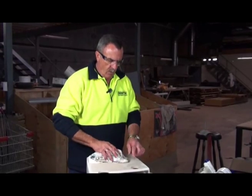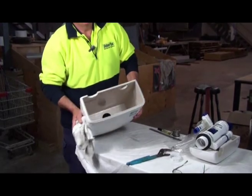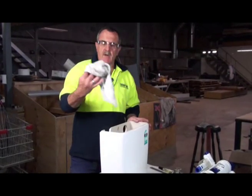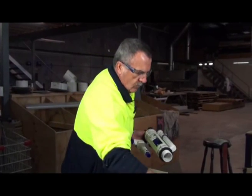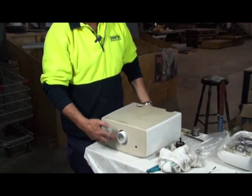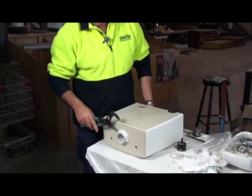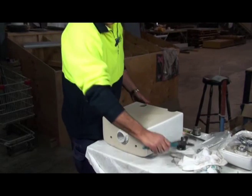After you've finished drilling your hole, just make sure you wipe off all the excess — not only on the outside but on the inside, because it could get in the way of flushing. If there are any big chips in there, just wipe it out with a rag. Once you've drilled, don't forget you've got to put your working mechanism back inside. Just reverse the steps you did to take it out — poke it through the bottom, spin the base nut back on. Don't over tighten, it just needs a couple of turns. Your plumber, when he installs it, will always check those things anyway.